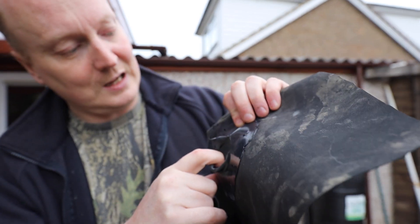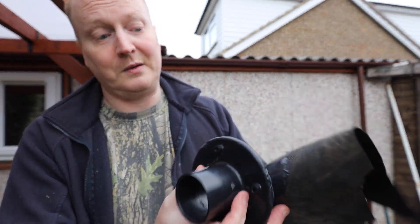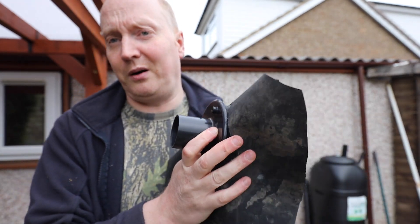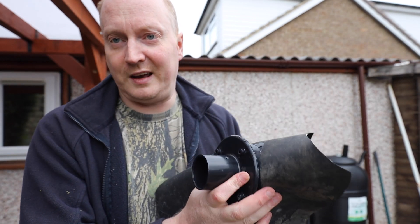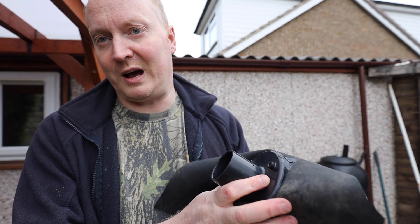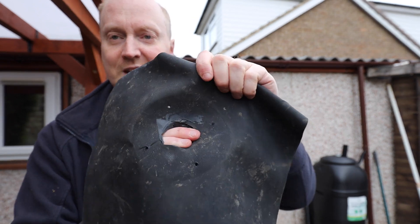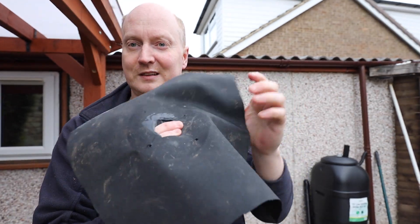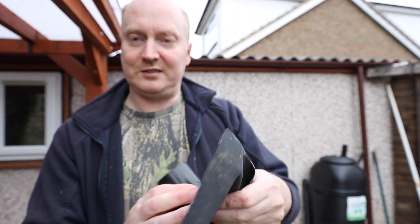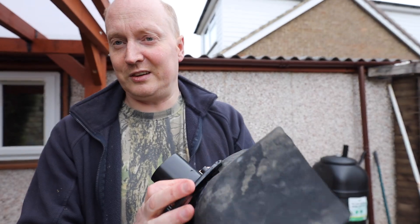We're going to get a really good seal, even though there is a bit of a kink in the screw area. Looking on the back, we've got a complete silicon seal around where the holes would be. If there's any weak point, it's going to be around the screws rather than the silicon on the liner. It's very important to get a good quality marine-based silicon, not something just off the shelf from your hardware store. I hope you found this video informative - remember to like and subscribe if you think videos like this are helpful. Quite an interesting experiment - thanks for watching and have a nice day.